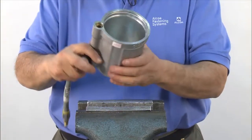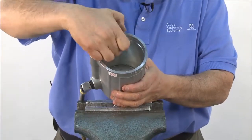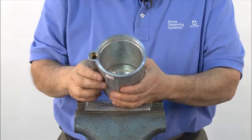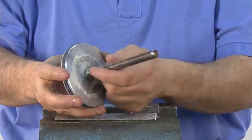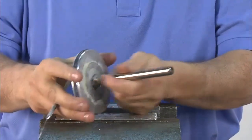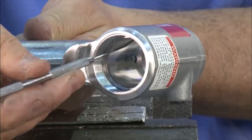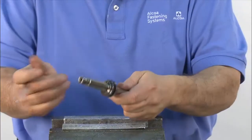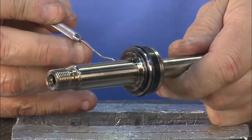This is a good time to inspect the inner workings of the 2025 tool. First, inspect the cylinder for scratches. If present, clean them up or replace the whole cylinder. Inspect the piston rod for visible scratches that you can feel with your hand or with a scribe. Also, inspect the handle and interior cylinder bore, looking for scratches and anything you can feel with a scribe. Finally, inspect the pull piston for scores and scratching on the surface area.